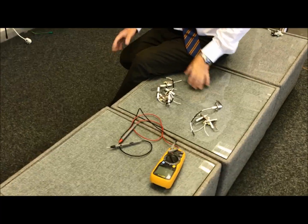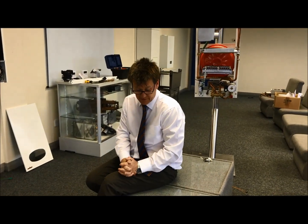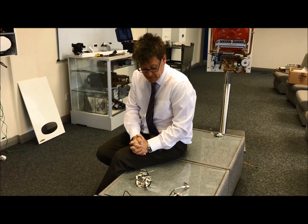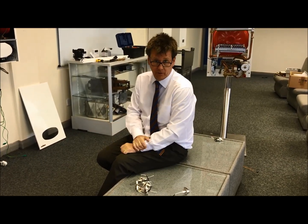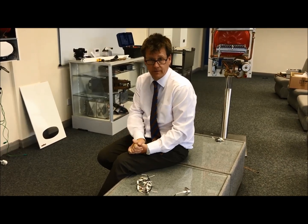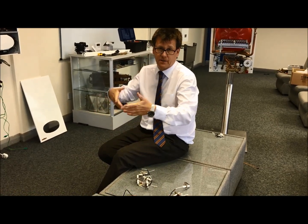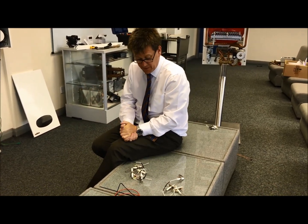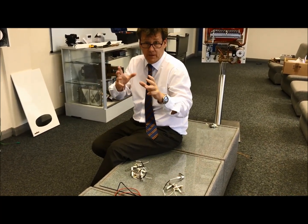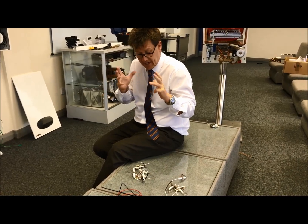There are five different manufacturers of spark electrodes here, and only one rectification probe. I see on many occasions on the forums where guys are taking pictures of boilers with aggressive ignition, and all the comments are coming in saying how bad it is — but in fairness, it really comes down to incorrect service and maintenance.